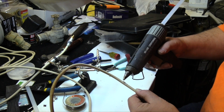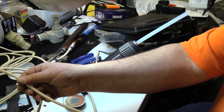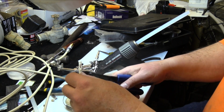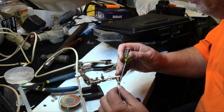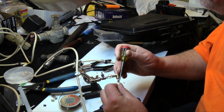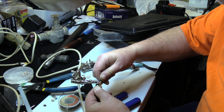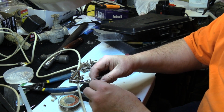I don't have any high-quality RCA jacks I could use to rebuild the splices, so I'm going to remove the jack from the shortest length and repair the longer segment. To begin with, I unscrewed the solder cover and slid it down the cable so I could begin disassembly. I spread open the wire crimp with a carpenter's awl. I was surprised how soft the metal was and easy it was to work with.